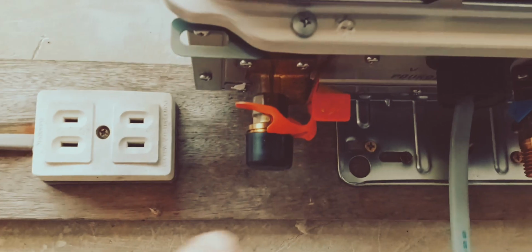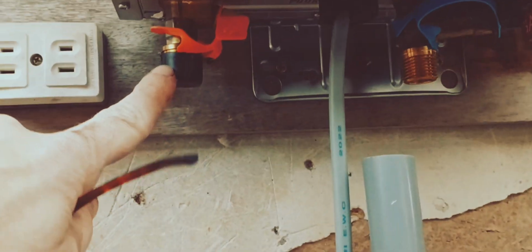And that's the gas connection there, but this is the hot water connection. This is the same size as this. I've already checked it. I'm going to run this straight down and just go in the wall right down here. On the other side, where it comes in, I'll run it over here in the corner and then along the baseboard, so it's not a tripping hazard. And over here to where the hot tub will be, or the bathtub, which is kind of like a hot tub in a way. And then, of course, the cold water pipe is going to go down there and along the baseboard and meet the hot water pipe right over here in the corner, right behind this door that I've got leaned up.